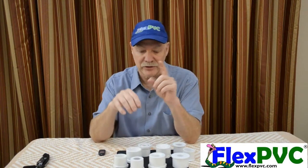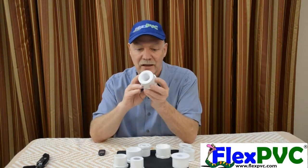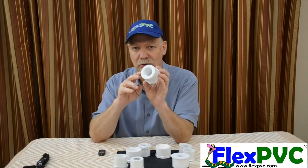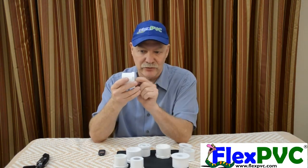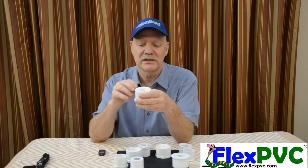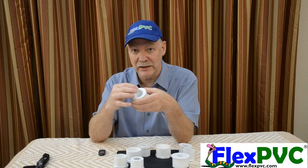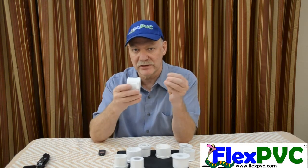There's one more situation — this one. This is specially made for drawing. In other words, you have suction here. You're drawing this direction; the flow of water is this direction. The reason it's special is because this has a nice big radius. This nice big radius is perfect for when you have suction on this side.